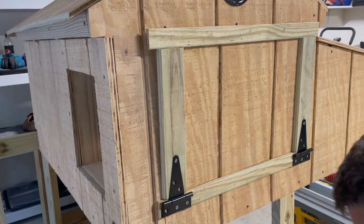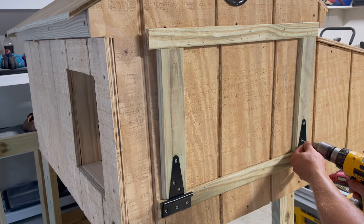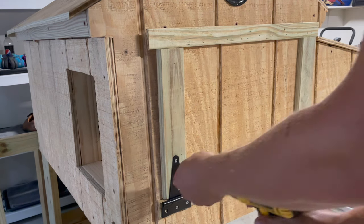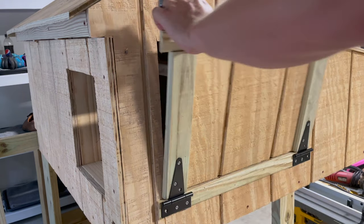The finished nails I was putting through there - a lot of them were poking through to the other side. I think they were inch-and-a-quarter finish nails so they popped out maybe about a half inch on the other side, and then I just had to buzz them off.